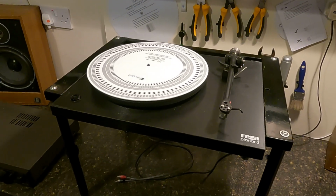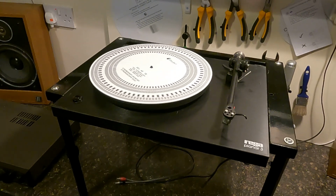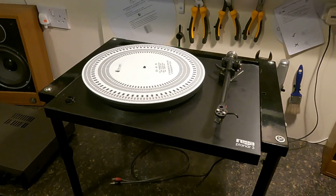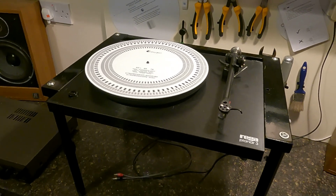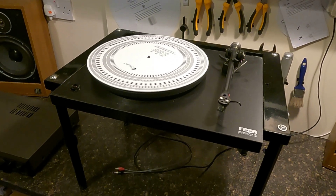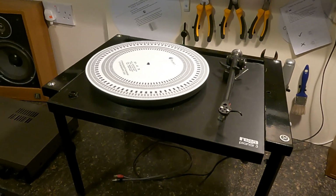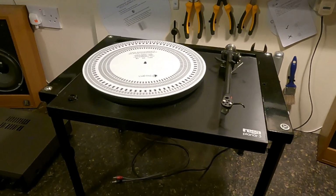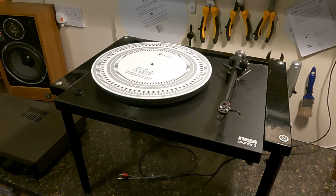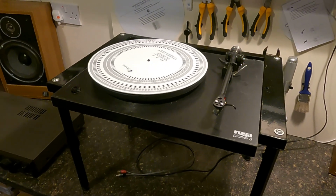The sort of failing after a length of time is the most common scenario with this. Probably 95+% of the time it'll be fine when it's cold, but when it's warmed up it starts to fall over and slow down. I have actually had capacitor failure on decks that have been stored away for a long time, because an awful lot of people are delving into the lofts and bringing these turntables down, and they haven't been used for 15+ years. So the capacitor has a long time to denature and fail. So some of those are actually failing even when they're cold.